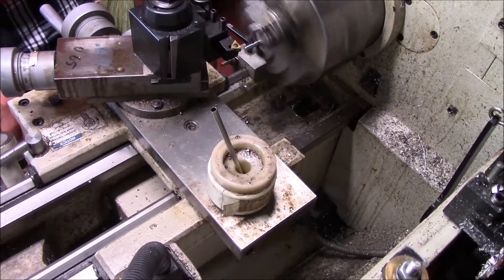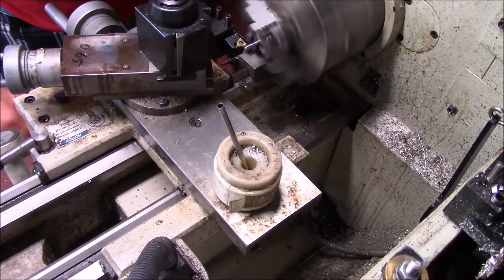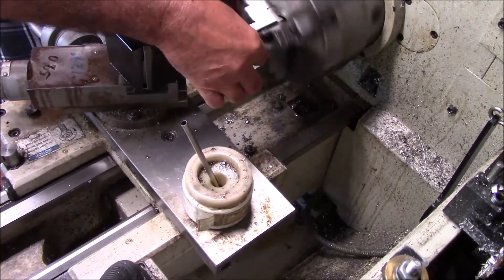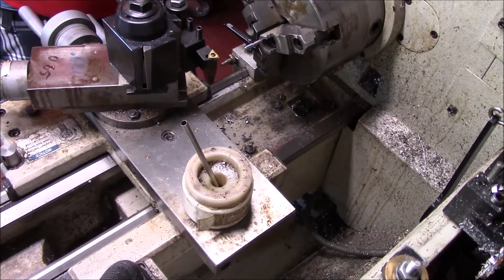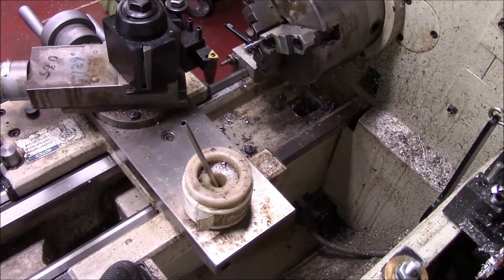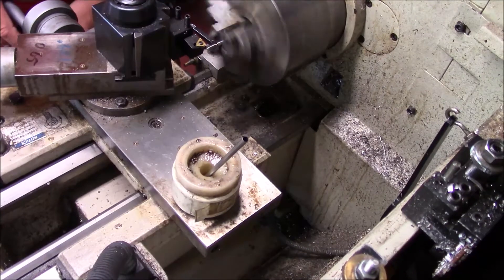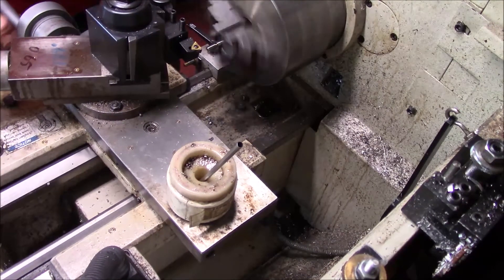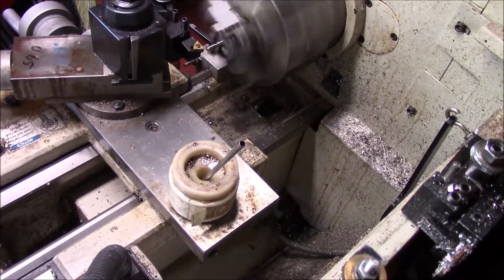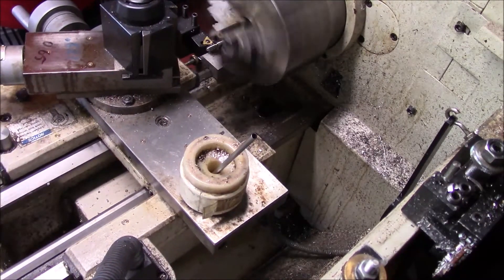I always prefer to use just one number and not switch it, because that way I don't have to remember — I don't thread a lot. The reason I'm single-pointing this is it's stainless steel and I'm threading this for a hammer. I'm checking — I know I'm not nowhere near — I just want to make sure that looks good. I've got to go about 60 thousandths or so. I'll bring you back after I get a little further down. I know there are formulas, but it's better to do what I'm doing and always remember.